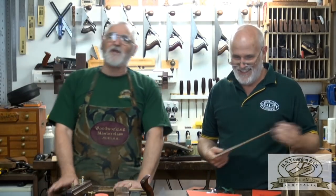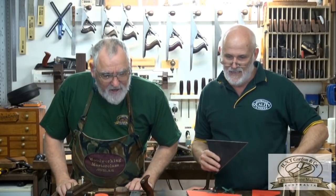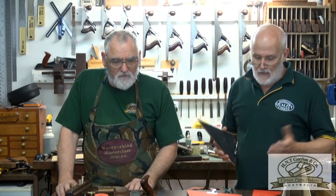Thomas on YouTube says he's never had good results with hand planes — probably a combination of buying cheap and not knowing what you're doing. Honestly, if you know what you're doing you can actually get a cheap plane to work, though it won't last long. A sharp 30-degree bevel is going to last three times as long as a sharp 50-degree bevel, no matter what steel is in that blade. Even with the best steel in the world at 50 degrees, I'd still back my 30-degree bevel.